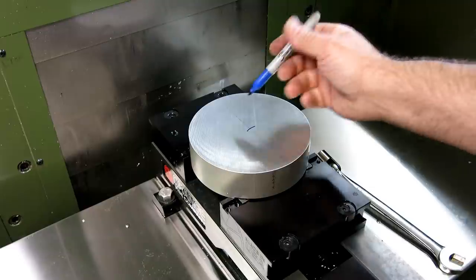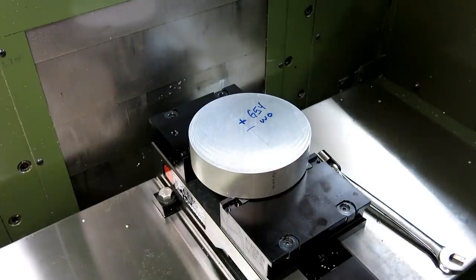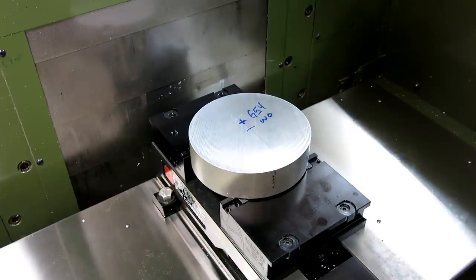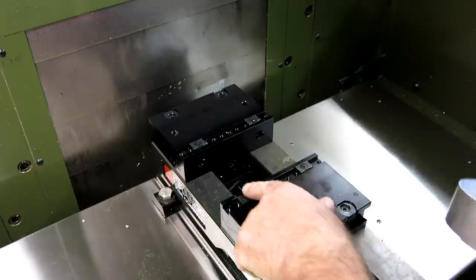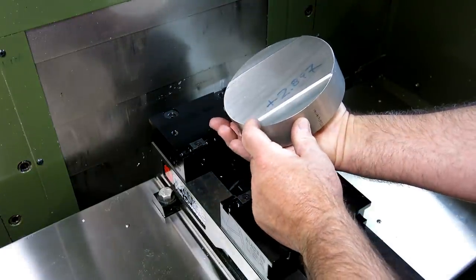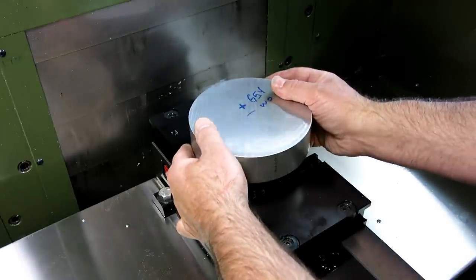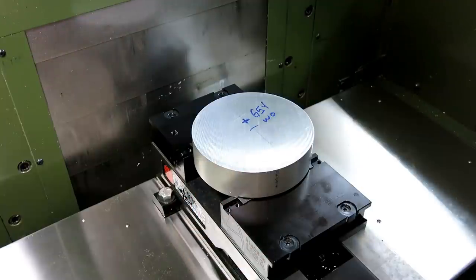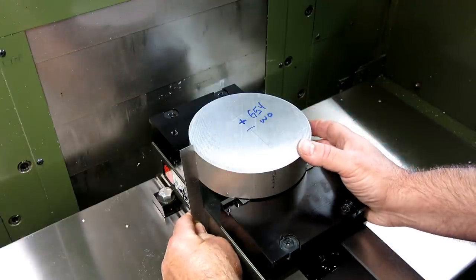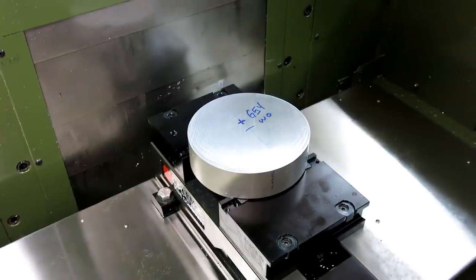The work offset — if that's the center — in this case it's shifted off. So that's my G54 work offset: on center but shifted off. I'm going to take it out of the vise so you can see. We're using these Talon jaws here, which can grab something like 60 thousandths of material with a little step. On the back here is exactly that — a little step to provide a nice straight retention feature. I'm lined up with the side of the vise for my Y position. Let's crank it down and not forget to tighten it up.